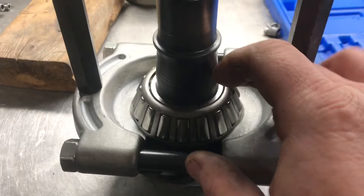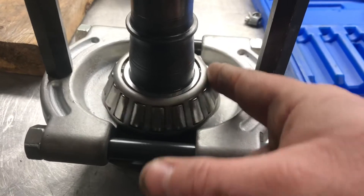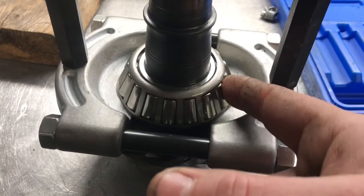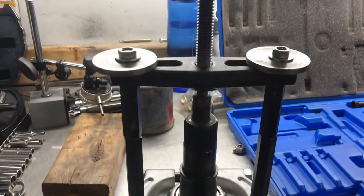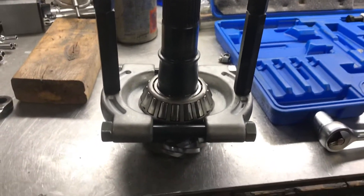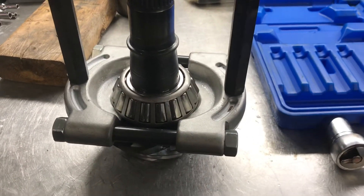Here it is all set up. What's important when you have a setup like this is that the bearing can still rotate. If you can't rotate this bearing, that means the puller is putting force on the cage and you're going to bend it and ruin the bearing. This is just a cheap kit I bought from Princess Auto here in Canada. If you're in the US, Harbor Freight would probably sell something very similar. This just barely does it but I don't really have the right tool.